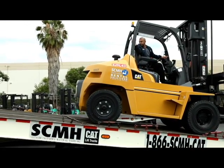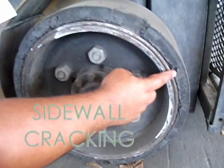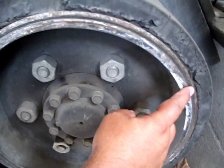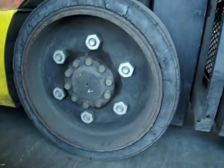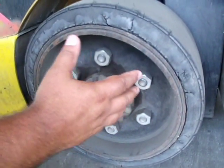The solution is operator safety training. Another failure is what's called sidewall cracking, which is a result of speed, uneven rough running surfaces, distance of run, or very heavy loads — the solution is to get a cooler compound. Cushioned tires can also have radial cracking, a result of tight turns while the forklift is not in motion or uneven surfaces. The solution is operator safety training to reduce speeds, or to order a better compound.